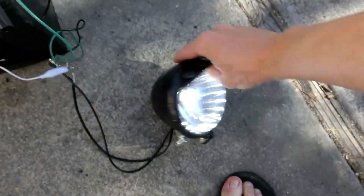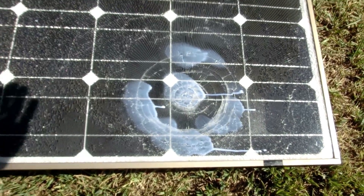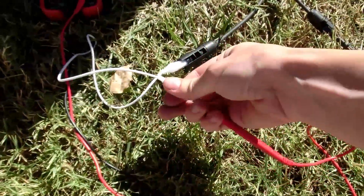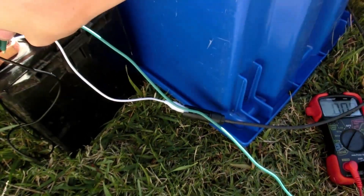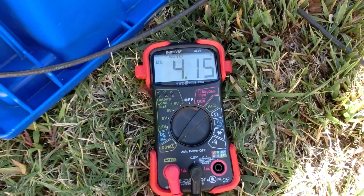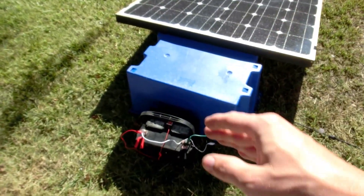Let's try to charge a battery with this now, because I just got a battery and I'm discharging it with this little bulb. It's down to 11.9 volts — going back up to 12 volts. It's starting to drip a little bit, but whatever. Just measuring the voltage, we get almost 32 volts — that's not too bad. Connect the positive lead... 4.14 amps, look at that. And it's at 13.1 volts now — that looks perfect to me. Although that battery could definitely use a solar charge controller, because we don't want to fry that battery.